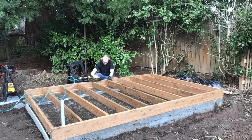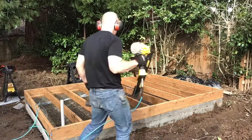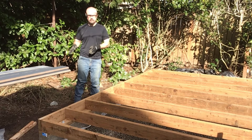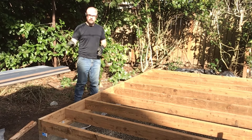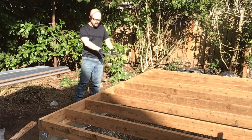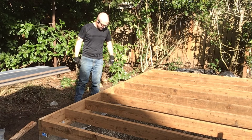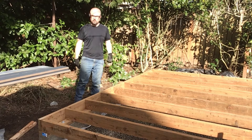Make sure to get each joist properly aligned and squared up before nailing it off. I'm using three inch galvanized ring shank nails. Ring shank nails have rings around the shank so the wood fibers grab them and they don't pull out as easily. I've got my car decking in — got the first six boards. This stuff varies a little bit. I tried to pick through it as best I could and got a lot of straight pieces. We're going to get about 30 inches out and put blocking in the middle between all the joists so they don't roll under load, then continue with the car decking.